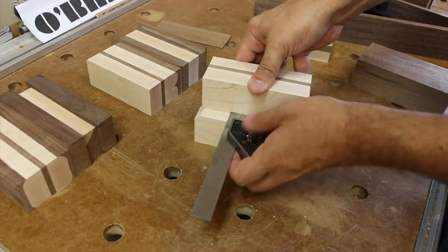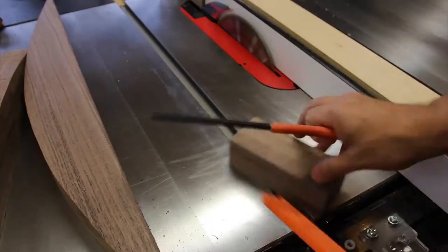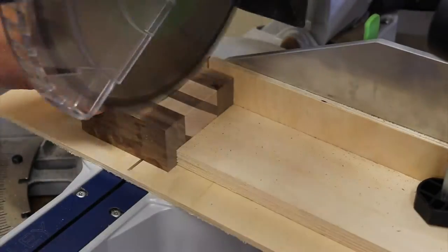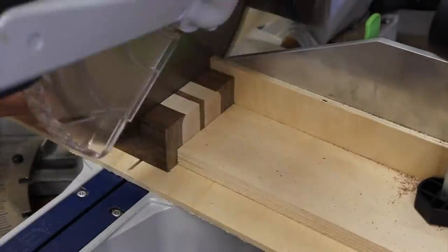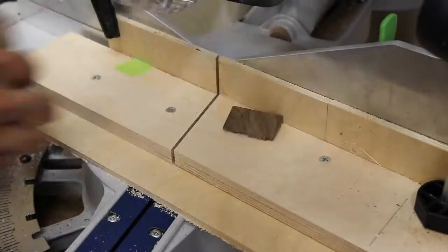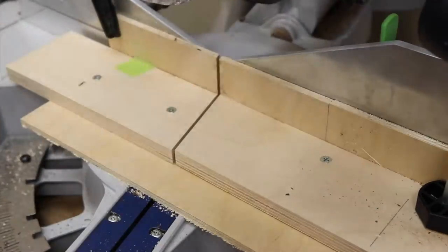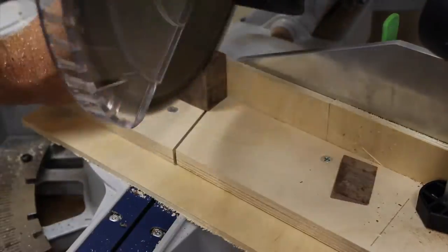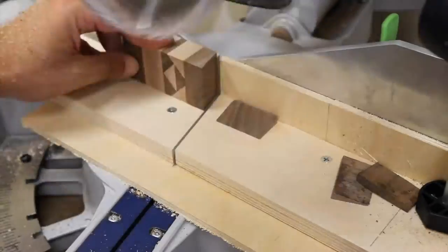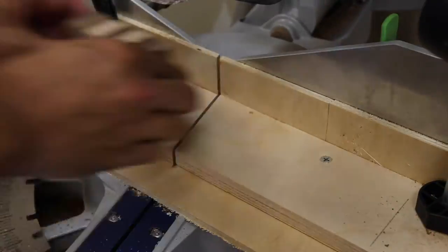Now that you've got all the individual letters worked out, the challenge of making a perfect fit all the way around the bowl is that every piece, when you cut it down, has to start out the exact same size. Since some letters were bigger and some smaller, we had to widen each piece until they had the same frame of reference. Once glued up, cut them down to the overall thickness — just over one inch in width. Then you turn it on its side, and using the appropriate angle with a little piece of tape as a point of reference, you flip each piece so it's cut to the same length, same angle, and the same exact thickness. This was just over 12 degrees on each side. What you end up with is a nice segmented ring that spells out the name all the way around in a circle.